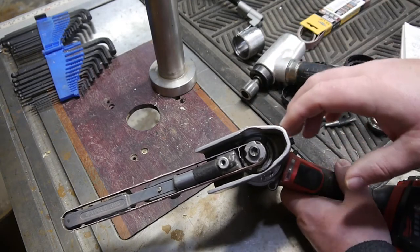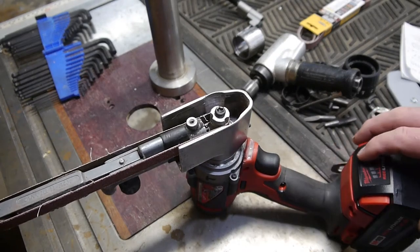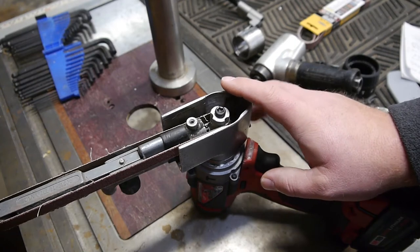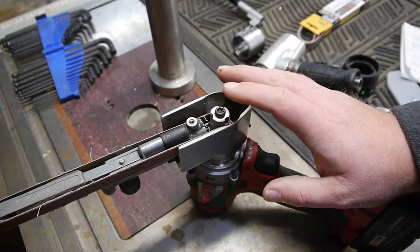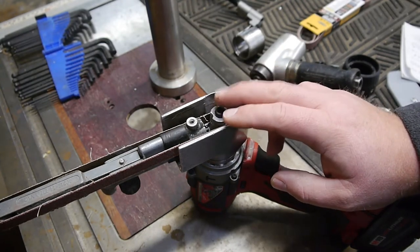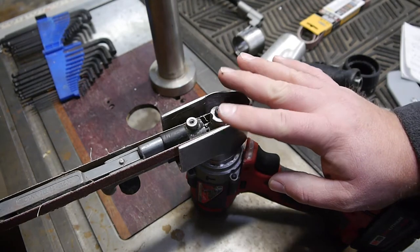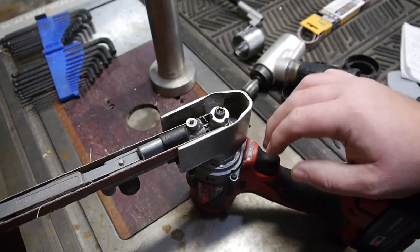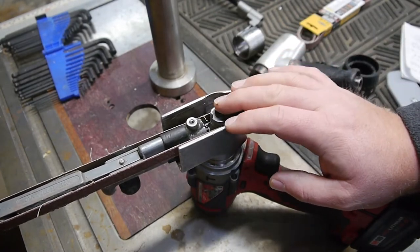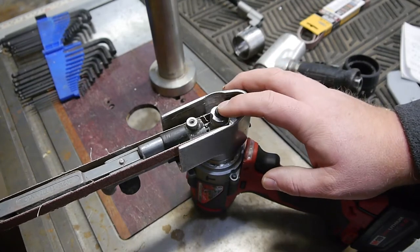A slow Dynafile is capable of roughly, I think, 1500 feet per minute. So we are 1/5 the speed at our max speed as a regular slow speed Dynafile. With that said, I usually don't go all out on those because they're freaking loud. Usually I go somewhere in the middle, so I think at max speed, this is just adequate. Really, we could probably increase this a little bit more in diameter and redo this.